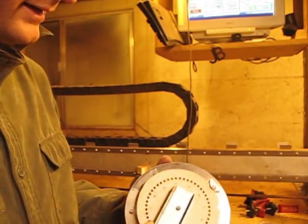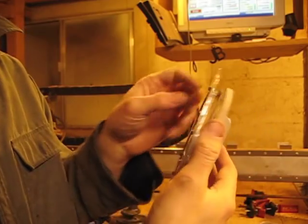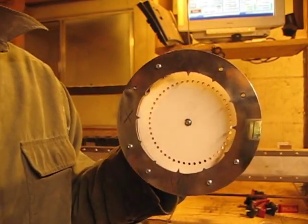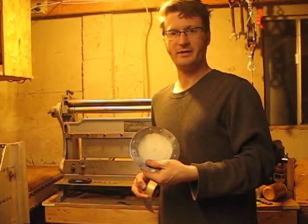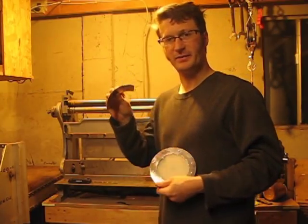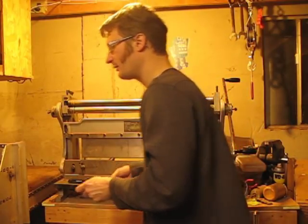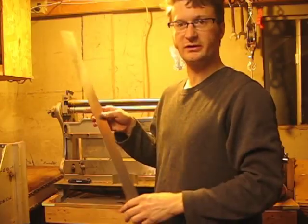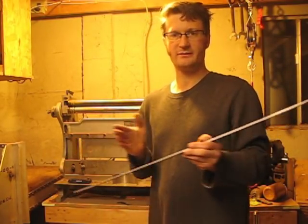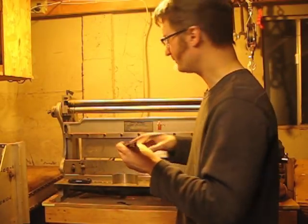One last piece and then I'll be done — I'm going to put a surround around this so that when it's hanging on the wall, if you come around to the side, you won't see all the internal mechanisms; you'll just see another piece of aluminum. I'm about to make the outer piece for my clock using the slip roll. I've done a little test piece just to get the radius about right, and it's looking pretty good. I'm working with a longer piece than needed, just to have a little leeway. Right at the beginning and end of a piece in the slip roll, it doesn't get quite the right radius.